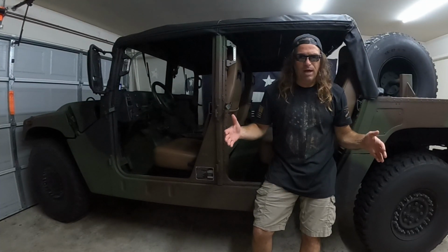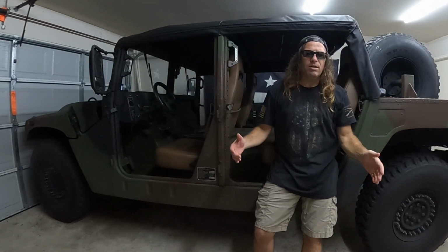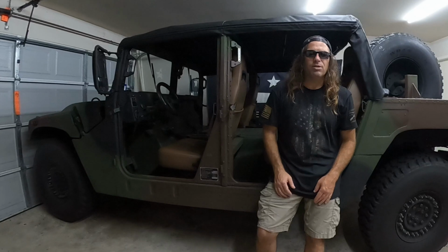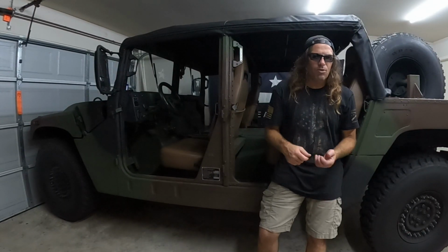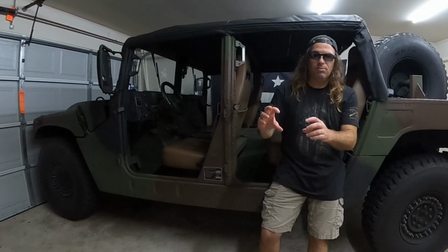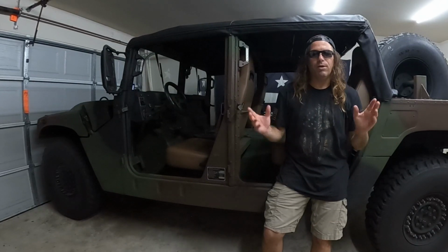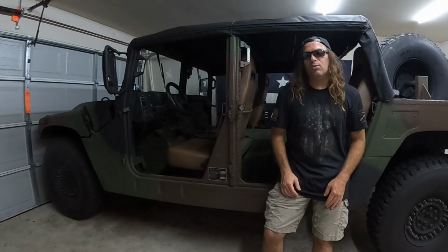I think what I'm going to do is, we're looking at the battery box. You've got the 24 volt bus on one side. What I'm going to do is kind of duplicate that on the left side with the 6-post red one for the 12 volt, and then with the black one, I'm going to use that to clean up the ground connections a little bit. We've got the existing ground bus, but what I want to do is take some of the connections off that, re-ring them, and connect them up to the bus, and loop the bus back to the existing bus that's in there, and clean up some of the battery connections so that I don't have wires going to the batteries. I only have the leads from the batteries going to the bus posts themselves to do what we need to do. So anyways, you guys hang out with me and we'll get that done, all right?